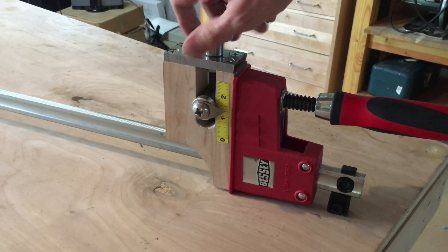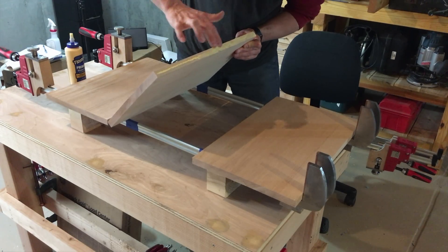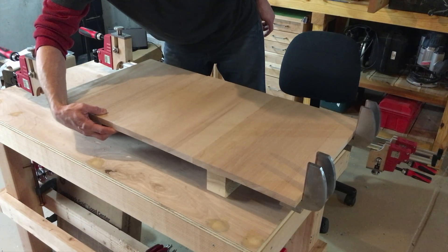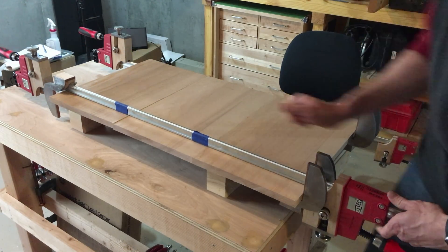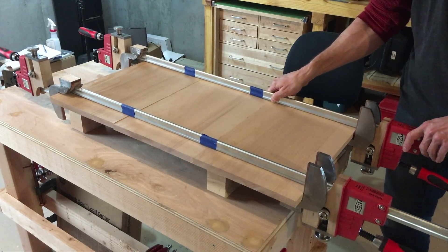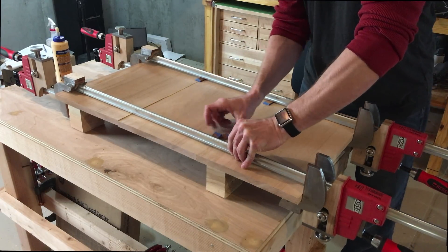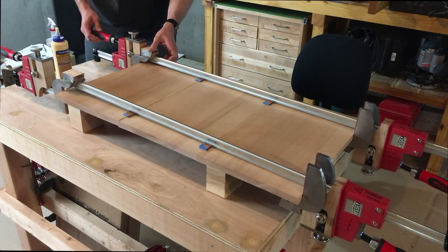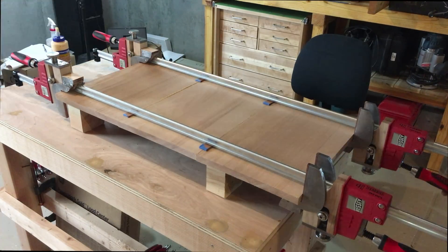Here are the four prototypes I needed to demonstrate a glue-up. The first step is to set the bearing height for the thickness of the material that will be clamped. I apply glue to the panel glue-up, and notice that I have a misalignment that needs to be dealt with by the four-way clamping pressure. The upper clamps are added, and I use some spacers to focus the vertical clamping pressure at the seams where it is needed. It's important to note that I'm glossing over a bit of complexity here with these spacers — if you want to get into the weeds on this issue and the solution, click here.